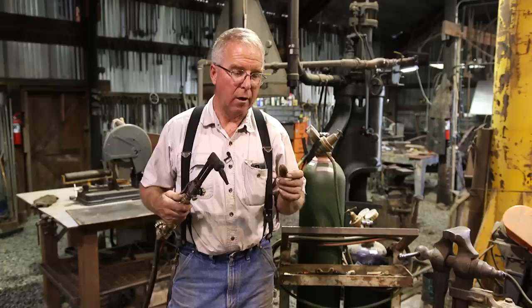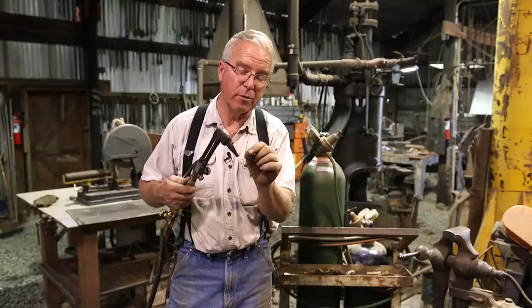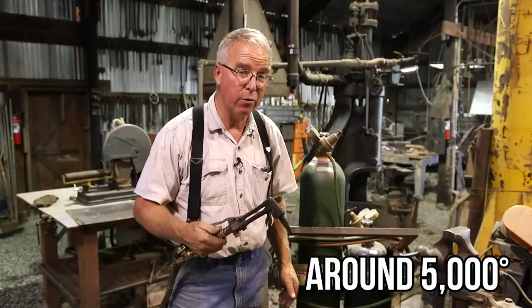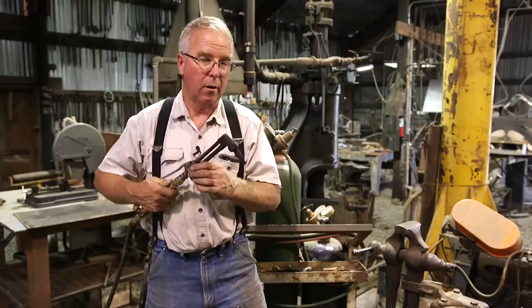I'm going to give you a little more global information on cutting itself, and in a future time we'll give you more specifics on different metals and pressures. But for now, here's what you need to know. Maximum temperature is at the tips of those little six white cones. There are six little bitty holes around the big hole in the middle, and your maximum temperature is at the tips of those cones. Not pushing those cones into the work, not holding back half an inch, but at the tips. You tip the torch so it's pointing in the direction that you're traveling. But you do not begin to move until you have a molten pool that you can see on the surface.